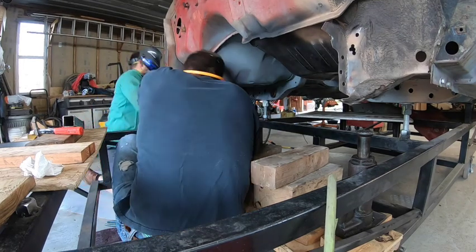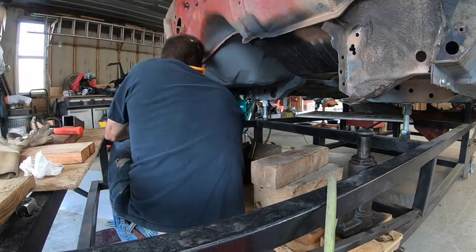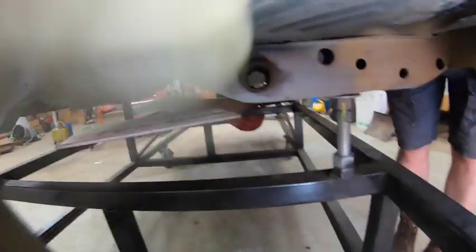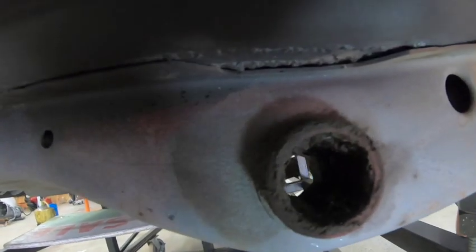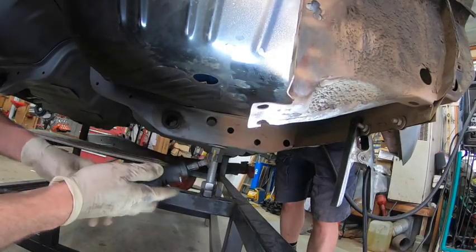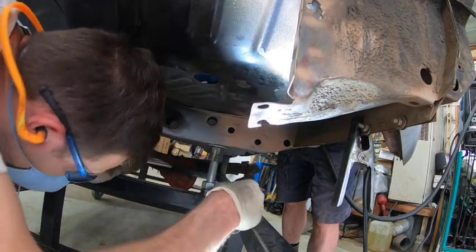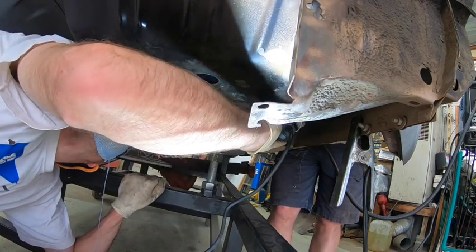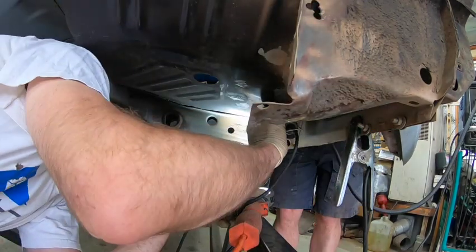While he's on top, I'm going to take care of some of this stuff right here — weld slag and crap that somebody left there — with the grinder. On this side we're also going to grind down that weld seam. It's a plug weld seam where the restoration shop patched this floor pan, and it caused a little warpage and not really a good seam.